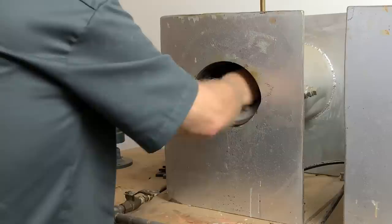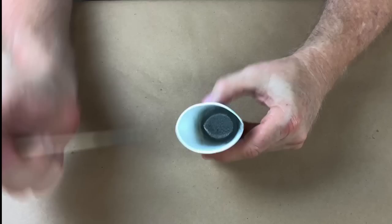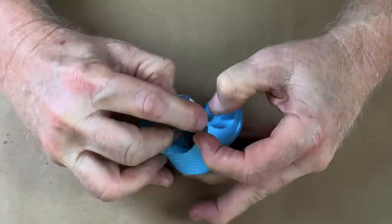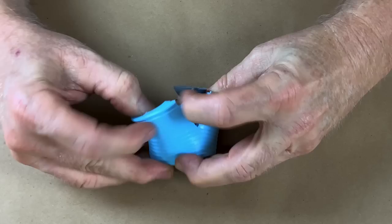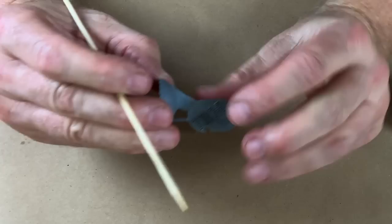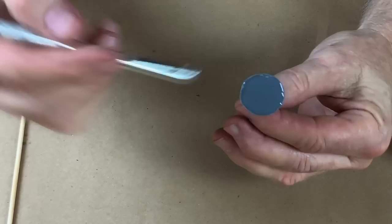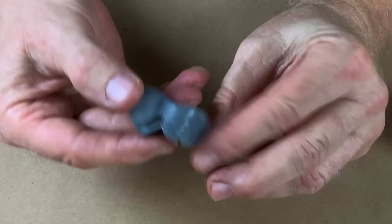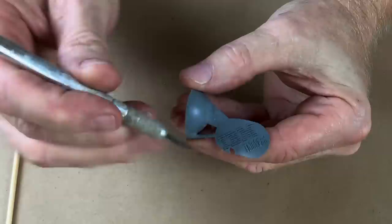Time to see what we've got — this is always the fun. Let's see what disasters await us. It might be too soft to pull — I'm stretching it. As predicted, I'm going to pull it out anyway because I can see we have troubles. So here's the classic thing. When I talked about surface tension — look at that. It's absolutely rock hard, but it's so thin, so paper thin — it's just incredibly, incredibly floppy. This is a classic example of what's difficult about casting really thin parts — it's really hard not to trap bubbles in there.